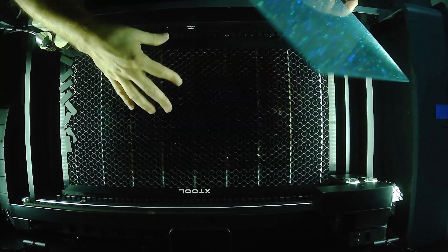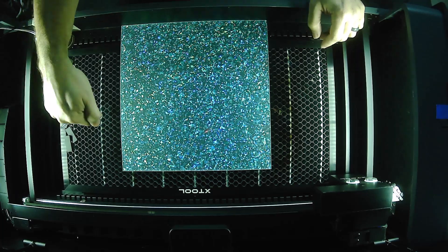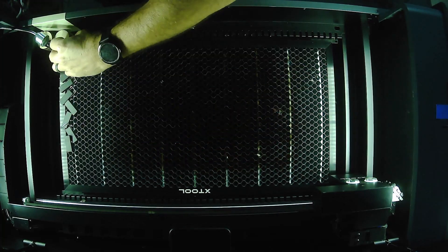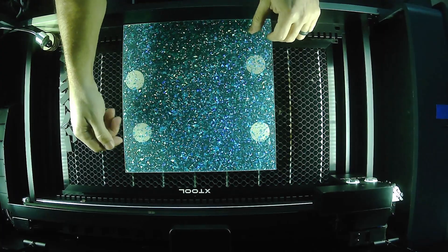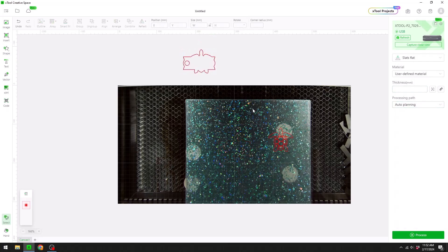I have the honeycomb in, but I don't want to put the acrylic directly on top of it. What I found is the laser hits through the acrylic and hits the honeycomb, it bounces back and reflects, and actually discolors the acrylic on the base. So I take some scrap pieces of three millimeter basswood scattered around and put the acrylic on top of that — it gives me an air gap between the acrylic and the honeycomb. For setting the height: if you want to use auto-measure, it's inaccurate with certain color acrylics. A trick is to lay a piece of paper on top of your acrylic, auto-measure on the paper, then remove the paper and cut.